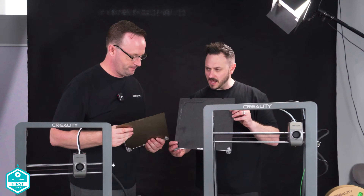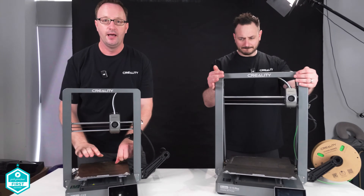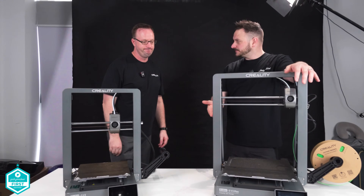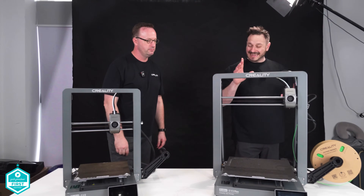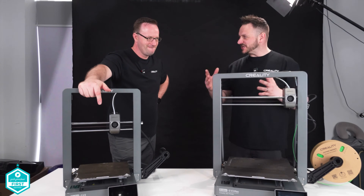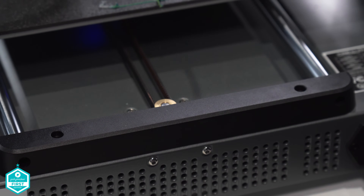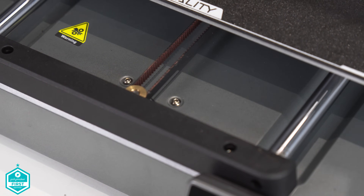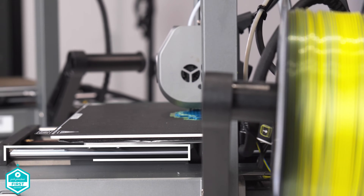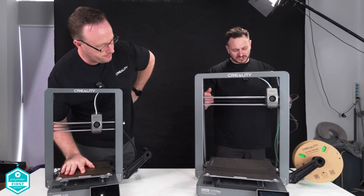That is — textured PEI. It's big, isn't it? So this is Core XZ though. Like the V3 is Core XZ. 600 millimeters per second. In order to get that speed, obviously you've got the speed in the belts here. On this one you have the same speed, but the key difference is that you've actually got a stepper motor here and another stepper motor at the front — you have a single one on the V3. So this has got two. Bigger plate, two on the Y-axis. And look at these beefed up rollers — much bigger. So bigger is better, plus size here.